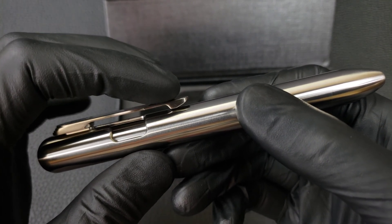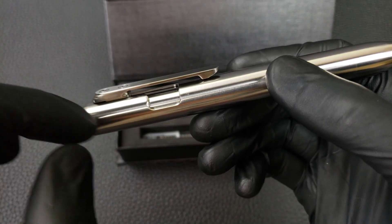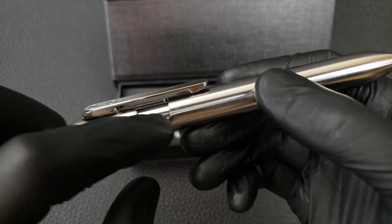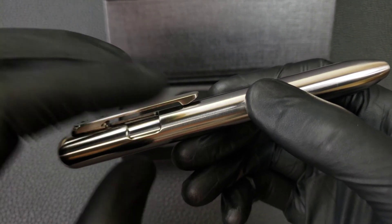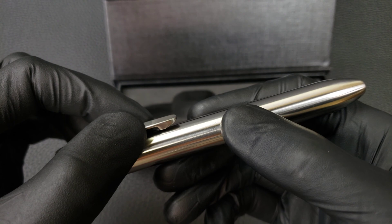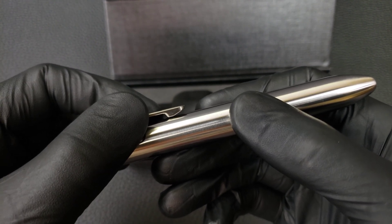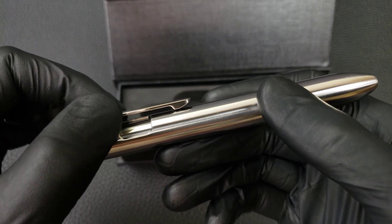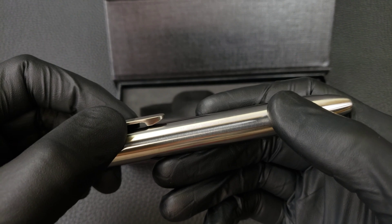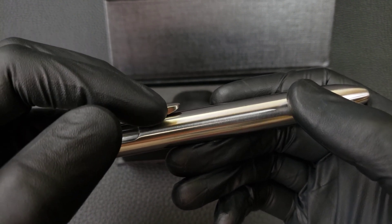Because of the tolerances in here that have to be fairly tight, the clip is only about 0.2 millimeters above the surface. It can't be too much, because if it's too much it's not going to clip onto your pocket, and if it's too little it's going to rub against the body really hard. So there's a very fine line between too much opening and too little.